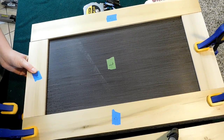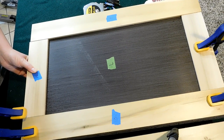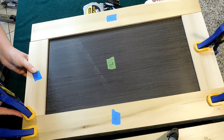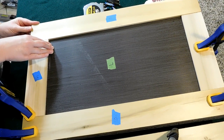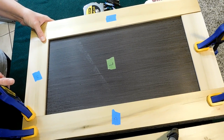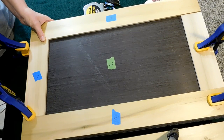What I do here is take another clamp and actually clamp these two pieces right together. This first piece is now in place. I take the clamp at an angle so you can see if it's still lining up on the edge, and now everything lines up to where I need it to be. Once that's tightened, this piece won't move and neither will the next, because this clamp is holding both pieces together. Then I can release one clamp and reuse it on the remaining section.